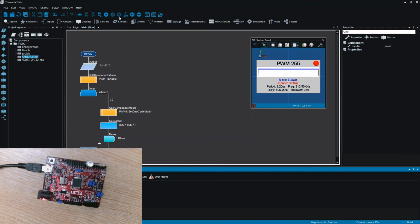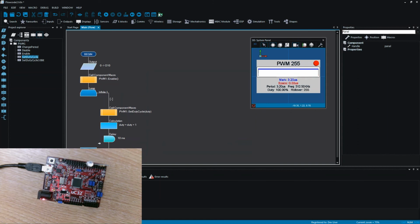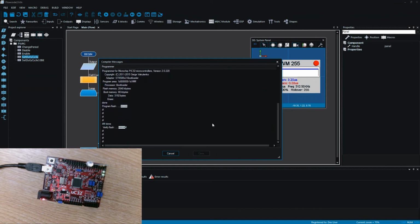If I stop the simulation, we need to set the programmer port, do we as well? That's right. So, okay. Under build and project options, you have a port listed here. I know that 17 is the port for the chipKIT board, so I'll select that one. I think all the other ones are Bluetooth related at the moment. Click OK, and then all we have to do is compile to chip, and it compiles and then it launches